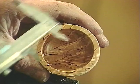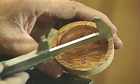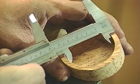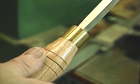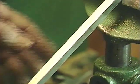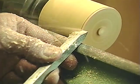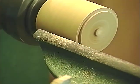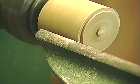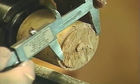I'm going to check the inside dimension with the vernier calipers here so that I've got this to check the spigot that I form to fit that lid on. I'm now going to cut the spigot with a 3/8 beading parting tool. This is a tool I like to use a great deal. Check the diameter with the vernier, a little bit large.